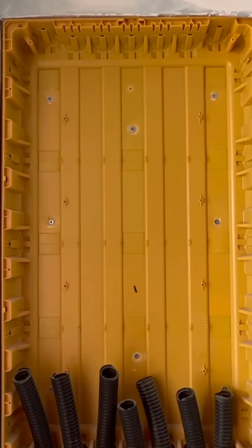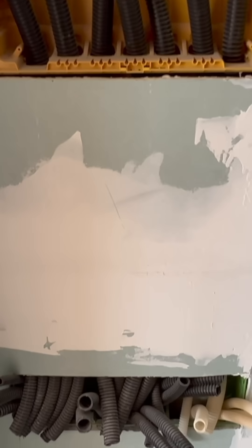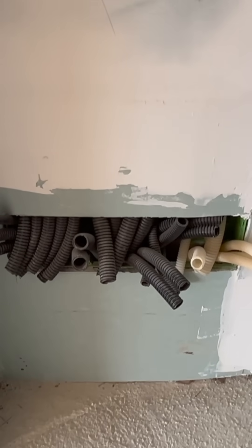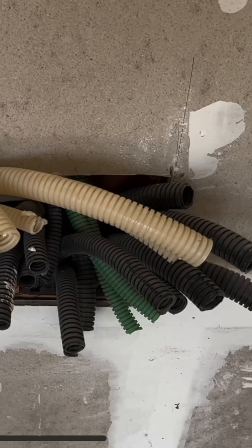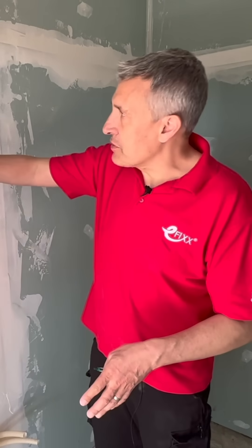This will be a three-phase system as well, so the circuits will be split among the three phases. The distribution board is here. Directly underneath it is the first of many junction boxes or cassettes where you actually do the interconnecting wiring between the different circuits. So you have the switching arrangements in there - you don't do that in the distribution board.